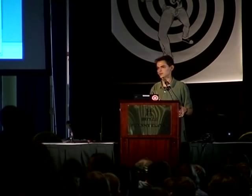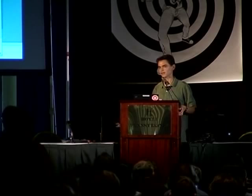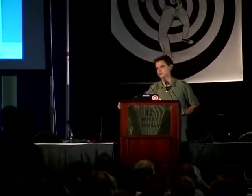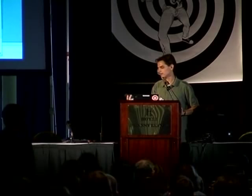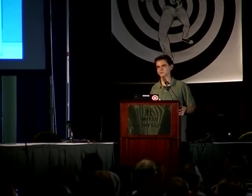Q: How do you tell the difference between the three tracks with only one head? Everything I showed is only tracks one and two. I have to unscrew the reader and move the read head to read track three, but track three isn't very exciting since it's all static data that never changes. You can use the same script to decode track three. The website is where you can get the software and articles describing how to make this reader, with pictures of the readers. All scripts — the DAB decoder and DMSB binary decoder — are available online. When soldering the read head to the wire, polarity doesn't matter; the peaks would just go in the other direction.